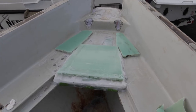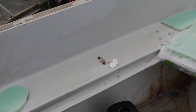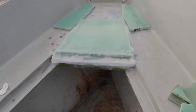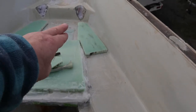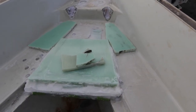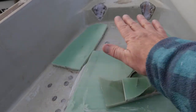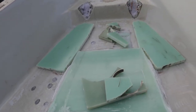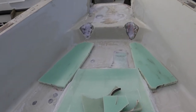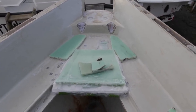Once that's on, we'll go to straightforward colloidal thickened epoxy to actually bed all the things into position — that's the main fixing and securing, stronger epoxy. Then we will use the micro balloons filler with the epoxy as we put in these little filler pieces to use up all our scraps of FR4, to fill that area and allow us to sand it all smooth. The idea is that this area can all drain out here — there's nowhere in there where water can puddle. These little filler pieces are not for strength, it's just there to ensure water can drain properly.